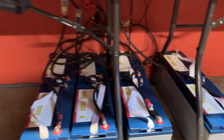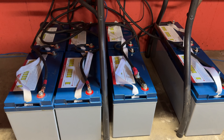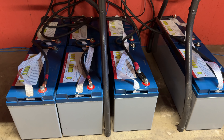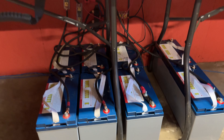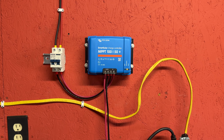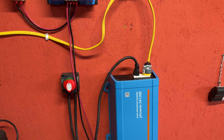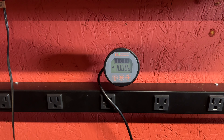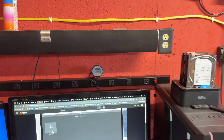I've got it all wired up — all eight batteries are now installed, giving me a total of 400 amp hours of storage. Luckily the sun was shining enough today that it charged the other four batteries up. I swapped it over, let it charge up, topped off the other four, put them back together, reset my shunt, and we're at 100 percent. We had really good sunshine today.